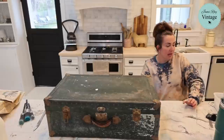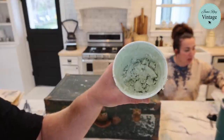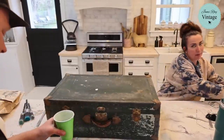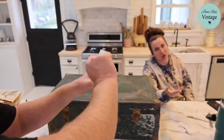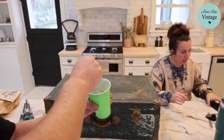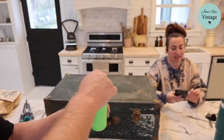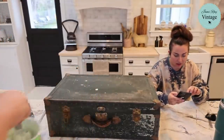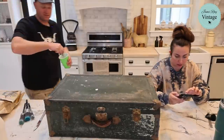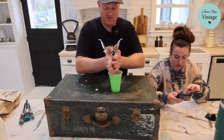Pauline asks: sometimes my milk paint is very frothy — is that ideal? Just let it sit; after you mix it, especially if you use an immersion blender or mix it vigorously, let it sit for 10 or 20 minutes and those bubbles should pop. Meanwhile I'm going to share the link on Facebook to let people know we couldn't get it to work.